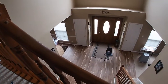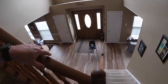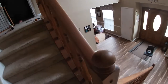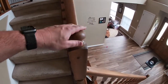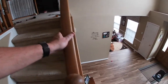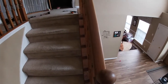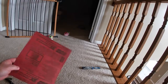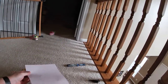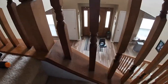All right, so we went through and used the Scotch pad. Some of these areas had really built-up grime - over the years people go around the corner, grab this, and oils and dirt just kick on - along with right around this area and wherever you touch all the time. You've got to make sure you get all that off, that's what the Scotch-Brite pad was for. We're going to go back and use 120 grit paper instead of 600 - I thought about it and 600 is way too fine for what I wanted to do.